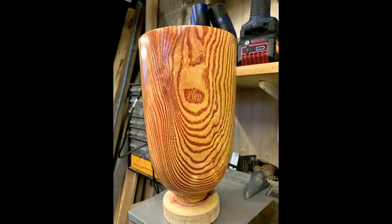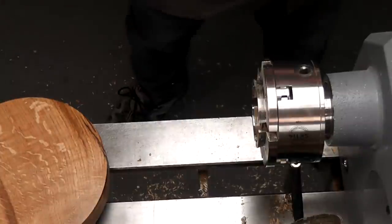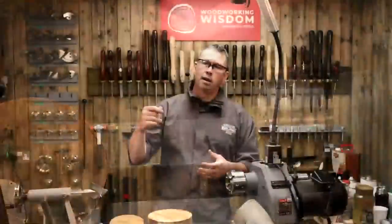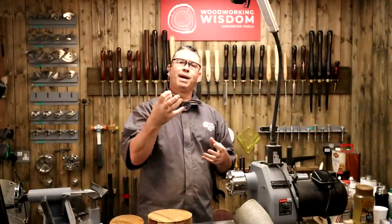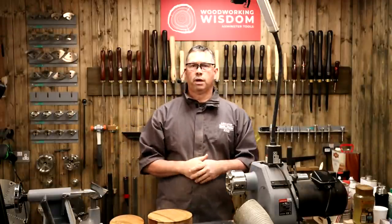You want to apply those, put your base color on. Generally, that's a dark color in most cases, blue or black. It could be a lacquer, like the ebonizing lacquer there. It could be a blue airbrush stain, dark black airbrush stain, all those sorts of things. But then apply your embellishing waxes over the top of that. It needs to pick out the structure of the timber, you see. So we don't want to fill grain when we're doing that.